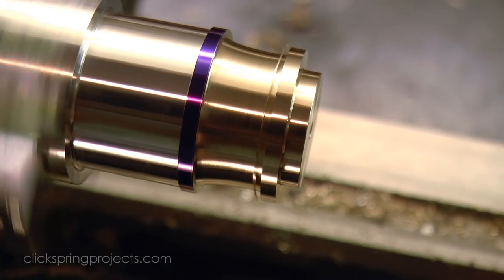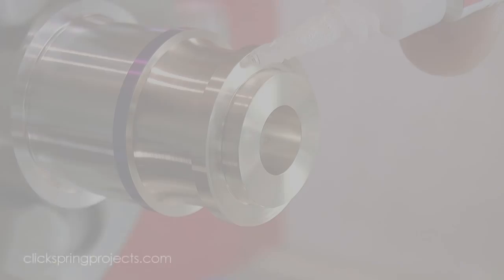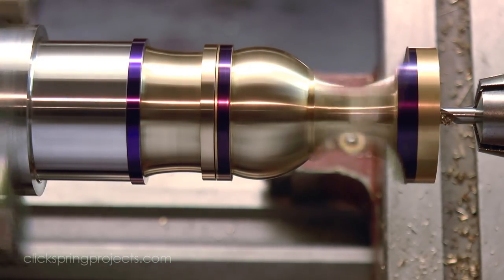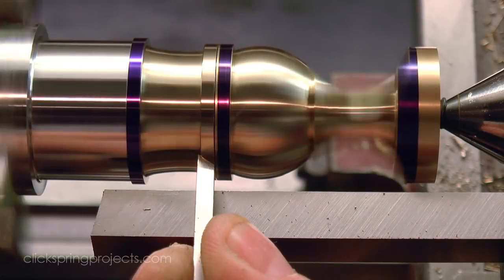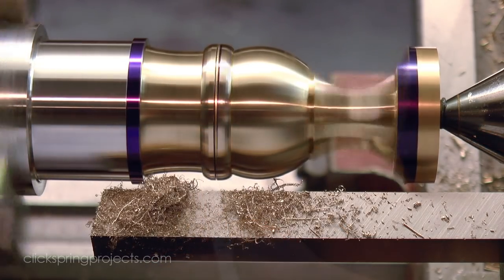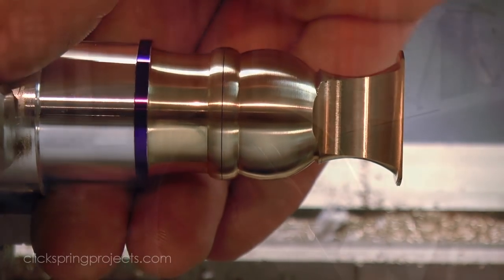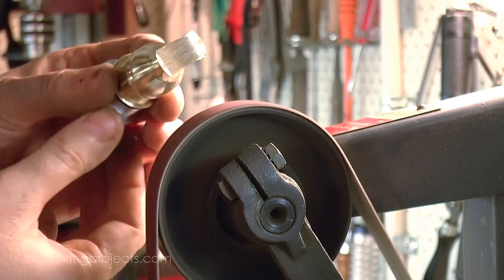The bearing surfaces are now essentially oil-free, replaced with a volatile material that evaporates to a waxy coating within a few days and provides no meaningful lubrication. What it does very well though is attract and capture dust. This forms an effective grinding paste that starts to erode the bearing surface. And to add further insult to injury, the aerosol application usually means that the entire mechanism ends up getting a good coating. So parts of the machine that would never be lubricated in any circumstance are now coated, attracting dust and slowly being damaged.